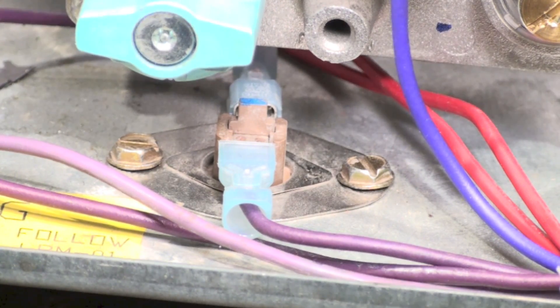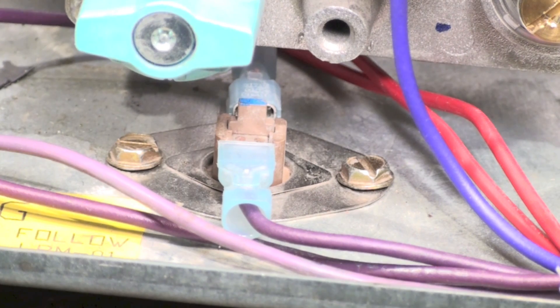The regular limit very commonly kicks off because of low airflow — clogged filters going on and off enough will cause it to stick off. You can kick it back on and then get a factory replacement part. If one of the manual reset limits has kicked off, then you're going to have to look closer at what's going on. Every time you look at a furnace, you should be checking the heat exchanger and watching how it cycles. Especially if you have a manual reset limit kicked off, you've probably got some sort of problem in there. And that is checking the limits.